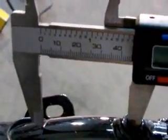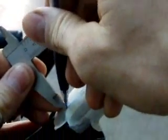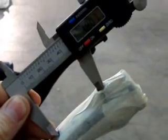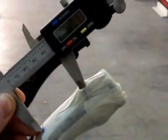On this next shot, we're going to be doing the same exact process, but instead of scribing it, I decided to use an ink pen. So here's the caliper in place, and you can go ahead and just mark that with a pen if you want, if you think that way is easier. Whichever way you choose, it really makes no difference. If you do the masking tape, just make sure the masking tape is stuck down very well to the seat tube. And then the same thing on this side, the next still image shows 1.8 inches is exactly where I need to make my front mark.